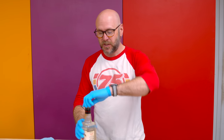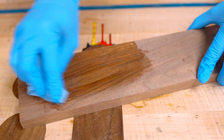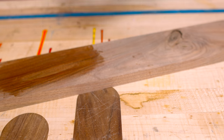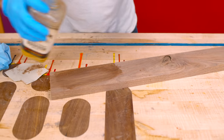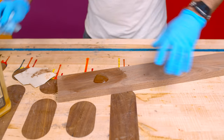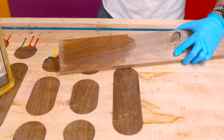This is one I use a lot when making bandsaw boxes because there are lots of curves and glue-ups. Sometimes you think you've sanded away all the glue and you don't know until you add finish. When you add an oil finish, glue spots show up a lot lighter. Don't worry — all you have to do is take a piece of sandpaper with the finish on there, sand away, and it'll blend in. Add a little more oil and it's gone. That saves my butt all the time.